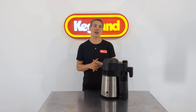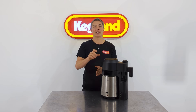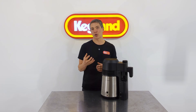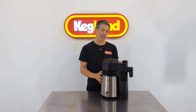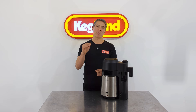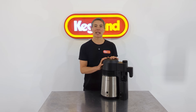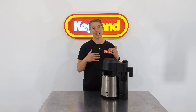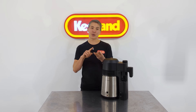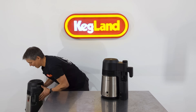If I'm going from, let's say, 92 to 94%, even though it only sounds like 2%, the impurities in that bit that's left in the final spirit are half as much — so it's a massive difference. If you're trying to make a neutral vodka base, and a lot of people using these air stills are using it to make a neutral base for essences, then getting that purity right up there is very, very important. The other thing is safety. A lot of people getting into home distillation worry about blowing the house up and ethanol fumes and stuff like that. So size, getting azeotrope, and also improving safety are things we've achieved with our new PolyPhoenix air still unit.